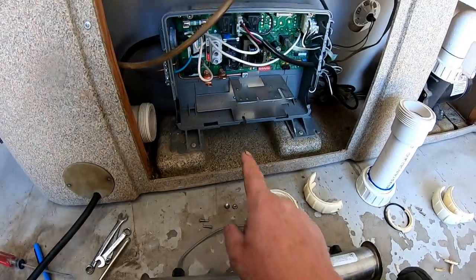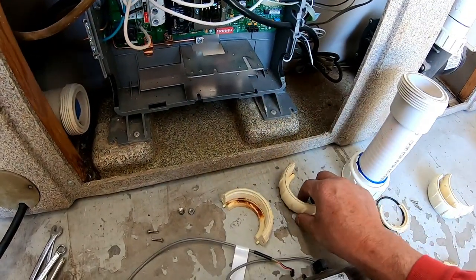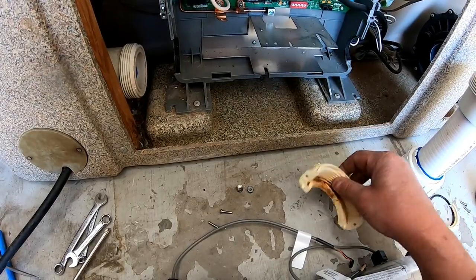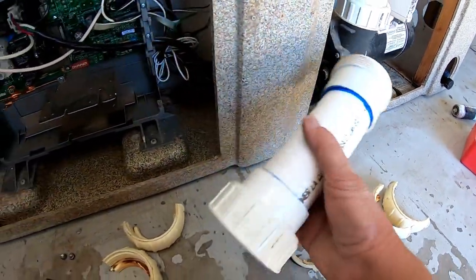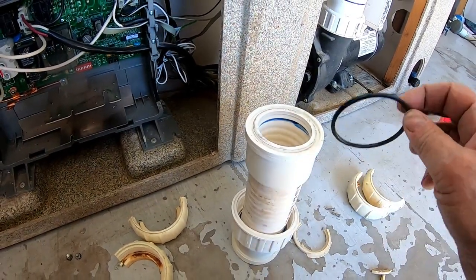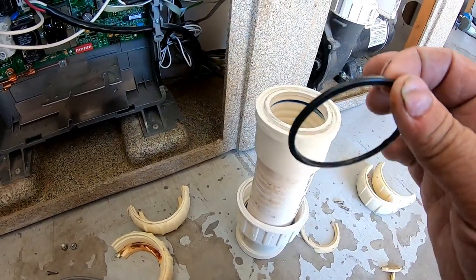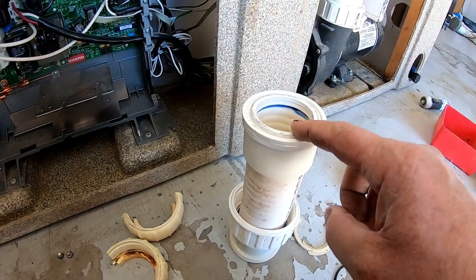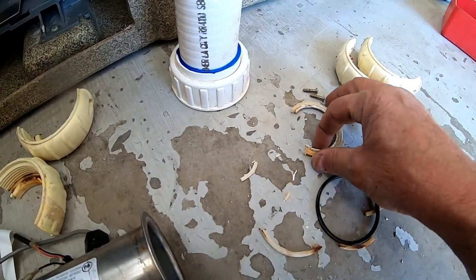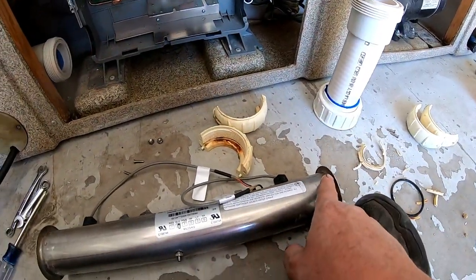I've taken the heater out of the pack — it's pretty simple. You have one union here and one there. I just took the Phillips head screws out of the unions and split them apart. On the pump and motor, there was an o-ring and it's supposed to be round, but this one is very flat — it's been squished. I'm going to put a brand new o-ring in here. On this side, the gasket is just falling apart in my hand — it's all breaking up. That was the same on both sides.